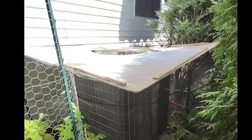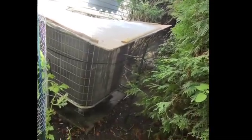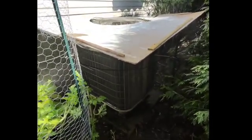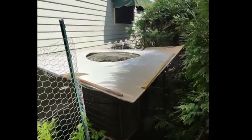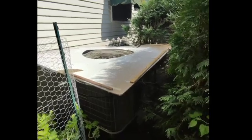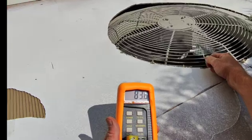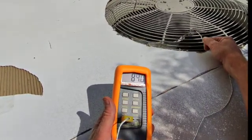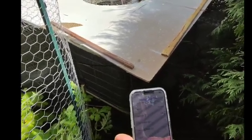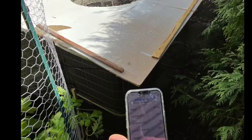Finally, we're putting all three together: we've got the nozzles moved out about a foot away from the unit to allow the mist to atomize a little bit more, and we've got a shade over the top to provide cooler air going into the unit theoretically. We'll see if that combined helps anything. I don't have a lot of hope for it because either one by themselves wasn't doing a whole lot. The temperature coming out of the top of the unit by the fan — as far as running amps with the cover on and misters pulled away from the unit, we're fluctuating between 7.8 and 7.9 amps, which is about where it was with just the misters attached to the grate.